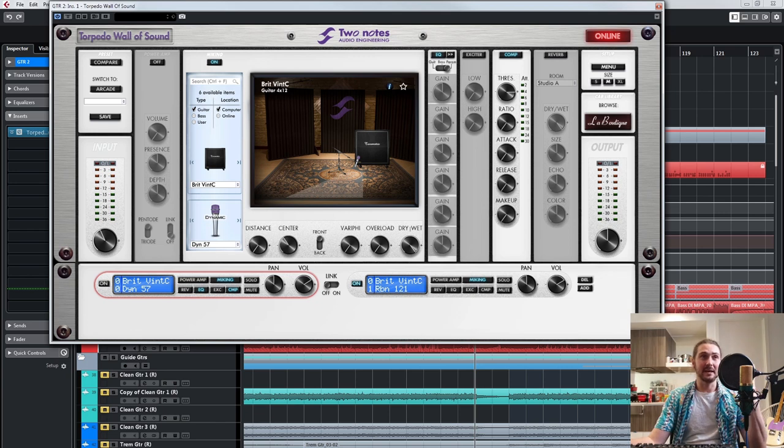But basically, it allows you to use a preamp or a pedal or something that doesn't have power amp saturation, doesn't have the power amp kind of tone, and adds power amp. And you have 8 different power amps, single-ended and push-pull, different valve types. You've got your presence and depth controls, pentode and triode. You can link them, you don't have to. It's fully featured and features power amp distortion.